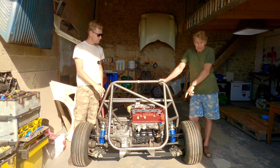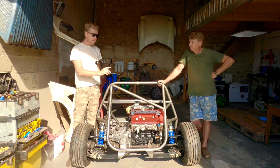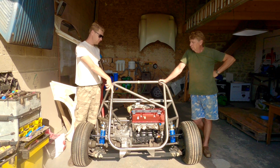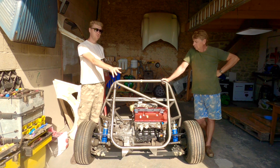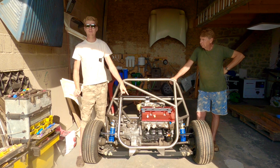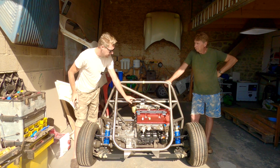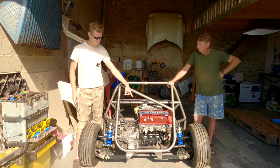Yeah. But it does have the heavy-duty drive shafts. It has the heavy-duty drive shafts, and this one has different cams because it's got Skunk2 cams, it's got a drop-in baffle, and it's got the RBC intake from the Euro Quad Type R, which is supposed to be the better intake, with a throttle body spacer and, I think, an EP3 throttle body.